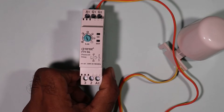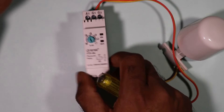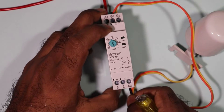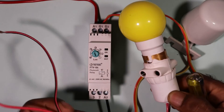After this, to operate this relay you have to provide AC power supply — that is, single phase power supply. Connect the phase supply at terminal A1 and connect the neutral supply at terminal A2. Now through this relay we have to turn on and off the lamp.